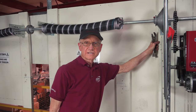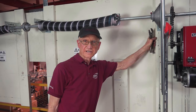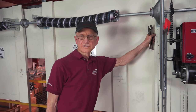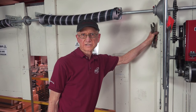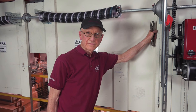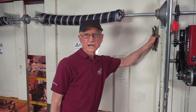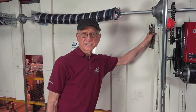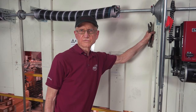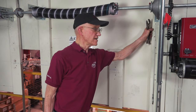I am Dan Music. In this video, I'll show you how the clutch works in more detail. I'll show you how to take it apart. I'll also show you how to change the clutch disc, which is one of the more common problems with operators, commercial operators. Sometimes the door will run for an hour or two. Something blocked it, something stopped it. Spring may have broken. The opener runs and runs and runs and wears out the clutch disc. So we'll show you how to do that.